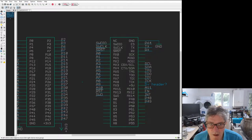These R0 to R8 can be anything we like, really. And I'm wondering how to use these. One possibility, which I mentioned before, was low power signals. I've got some spare 1.8 volt signals that I could use, for example, on a black edge ECP5 based solution. I could also do something with those signals on the module itself.